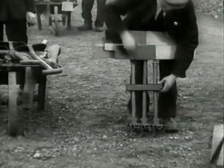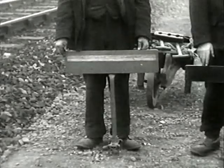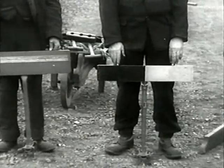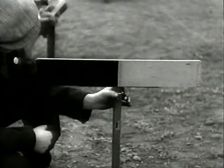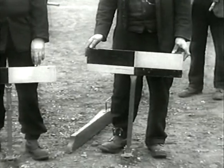To measure how much the rail is out of level when no traffic is on it, a set of three sighting boards is used: the sight board, the intermediate board which is adjustable for height, and the target board.